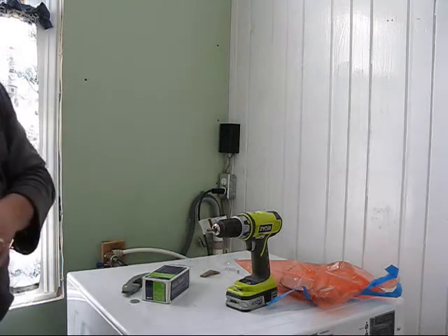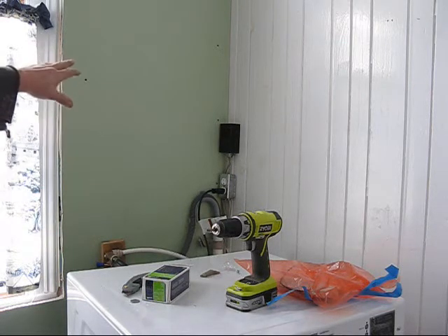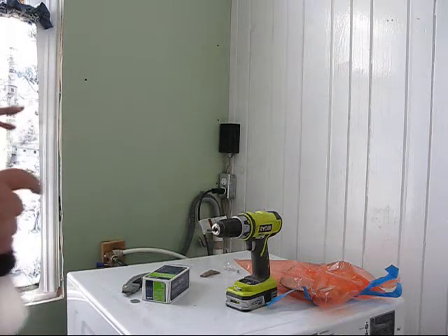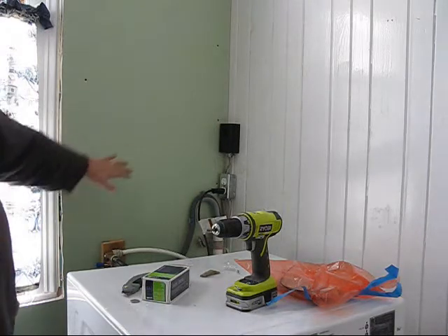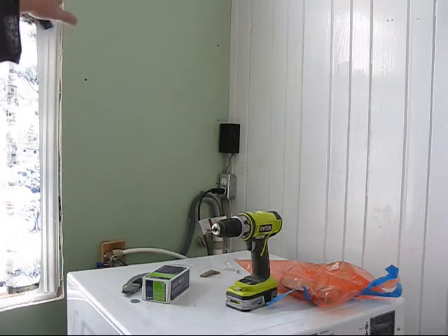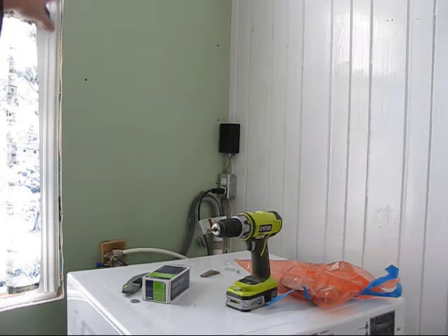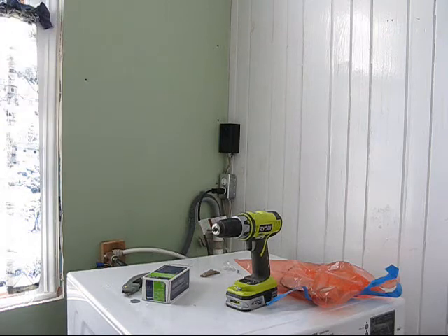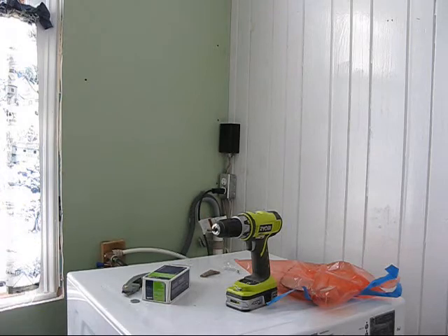The first thing I'm going to do is clean this place up — I've got tools and stuff scattered all over. I'll slide the washer back into place, get the dryer in here, measure where the hole is going to go, get my vent kit out and install all of that. I'll probably throw a sheet over everything while I'm cutting the hole because that's going to make a heck of a mess. I think I'll drill it from the inside — draw a circle, drill it out with a big long drill, then go to the outside and peel out all the wood, so most of that stays outside and not inside on the floor behind the washer.